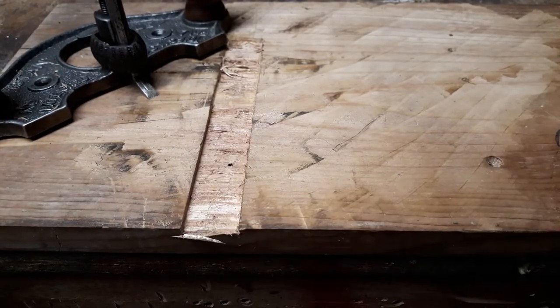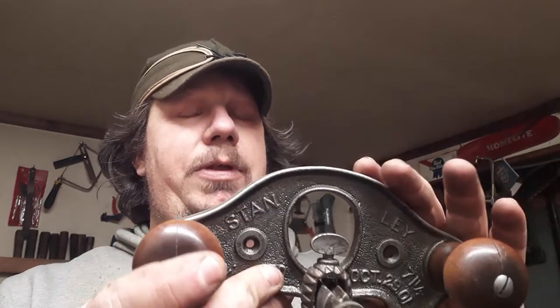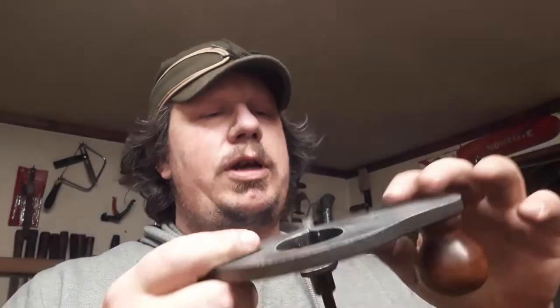You get the idea, stop dado. There, it looks a lot nicer, I think. Wax it up. Stop it from rusting any more than it already has. These had a nickel plating on them, which protected a lot of the top. My wire wheel took off the little bit that was left over, but gave it a nice look. I'm happy with it. Got some pretty heavy pitting on the bottom, but for the kind of work I do, it's fine.